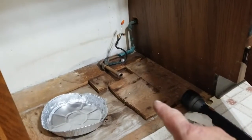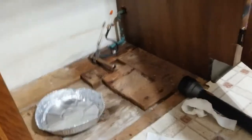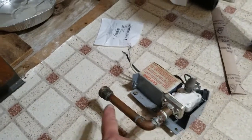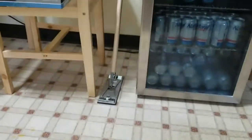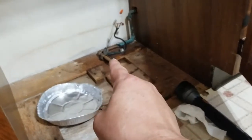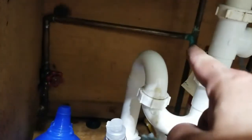There was a dishwasher that was in here. I disconnected it — turned the water off. The power is still hooked up, I can work with that. This valve here goes into the washer and there was a union I had to break. I turned the water off, broke the union, drained the water out. Now what I want to do is put my refrigerator in there. It'll fit with enough clearance. But how am I going to get that copper pipe out of there? It goes into this cabinet and there is a shutoff that goes up into a T that goes into the hot water.